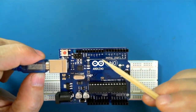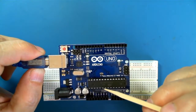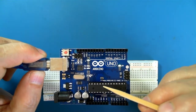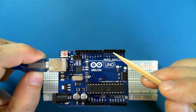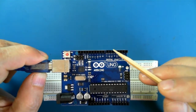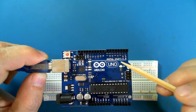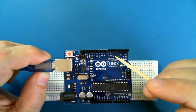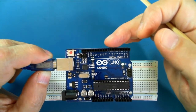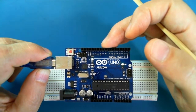Now there's a funny thing with these pins. The technology used in the chip is called CMOS, and CMOS has a property called very high impedance input. In other words, each digital input is like connecting a 10 megaohm resistor to it. It requires very little current to change the state of an input pin. The advantage is that you can use these pins as capacitive sensors.